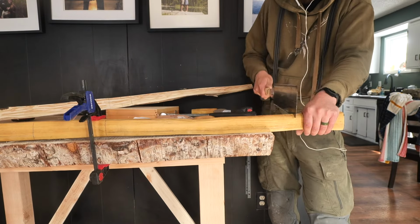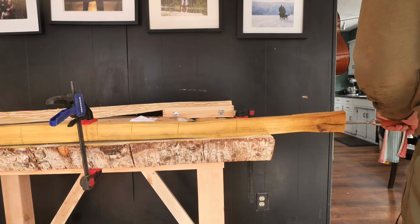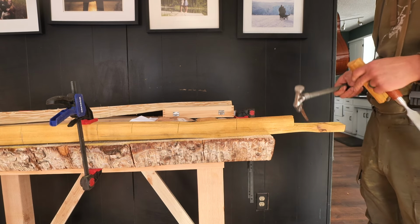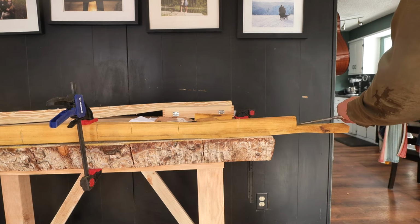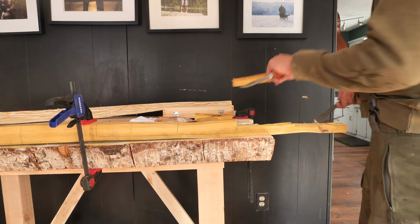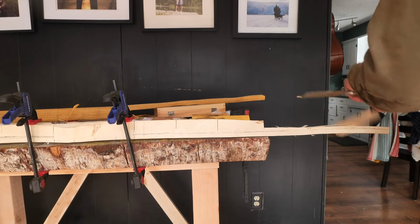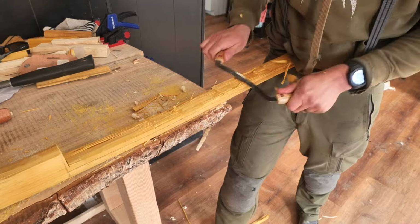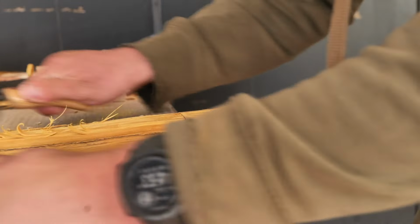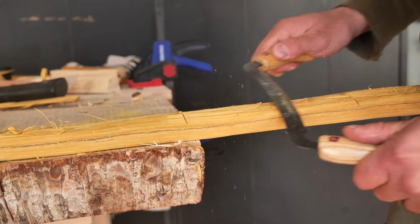And then once I get it there, I'll draw my tapers and make this the shape of a bow, but it won't be bending yet because this is still too thick. The sawing and de-chunking of the wood to get it into bow shape was identical for both woods. I think that Osage is a little bit easier to carve and maybe even saw a little bit faster. But to me, that would suggest that it's a softer wood, so I'm not sure what that will say for the performance of the finished bow, but we'll see later.